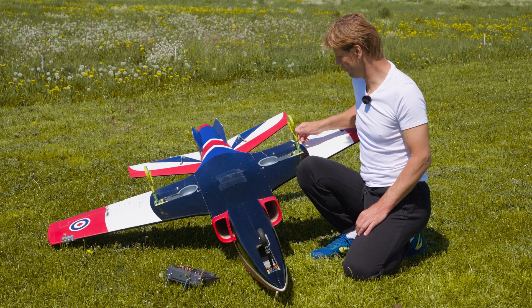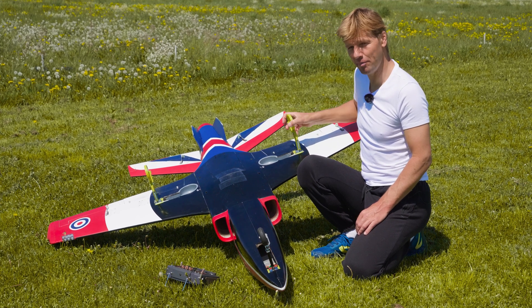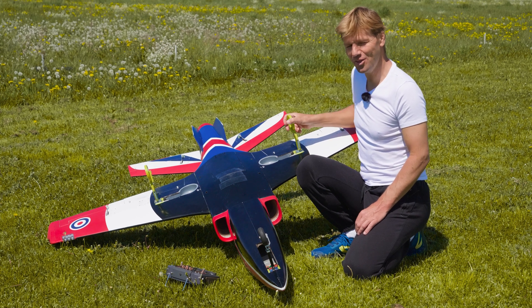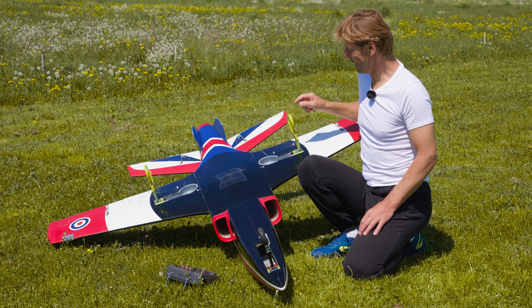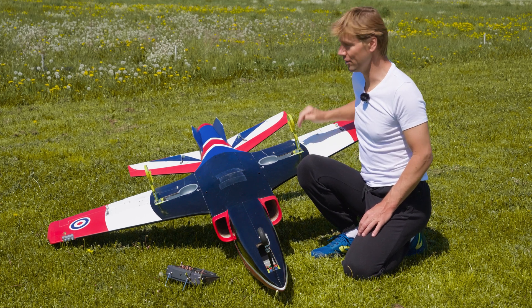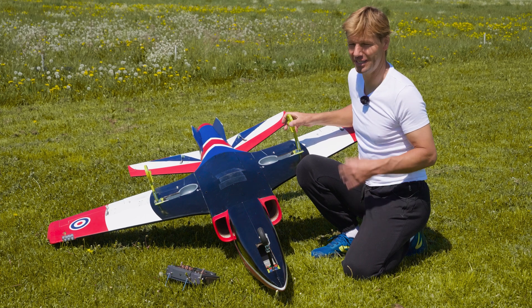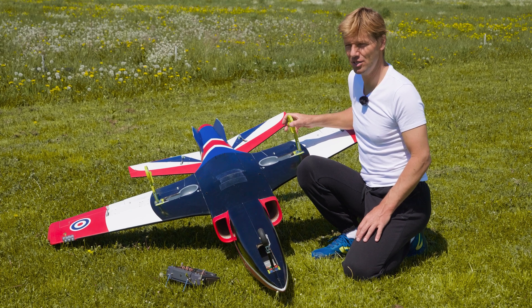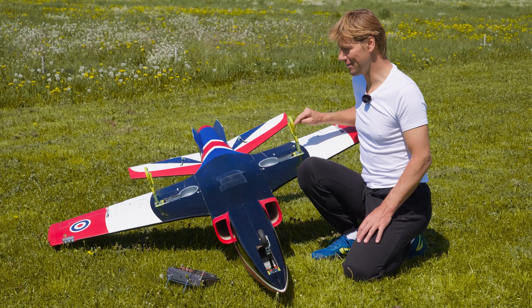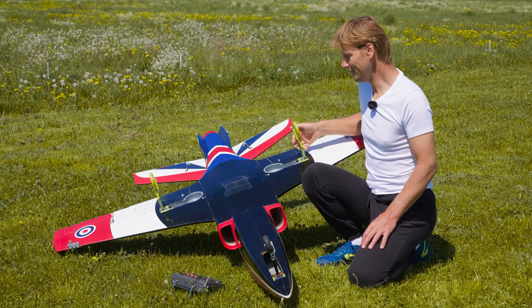It was bending and it was just a lot of trouble. The landing gear for Blackhorse Viper pivots a lot, but not enough for a strip like this. I measured that the travel of the wheel with the original — actually the modified original I was using — was about three and a half to four centimeters, and this one has six or more than six, so I increased it a lot.